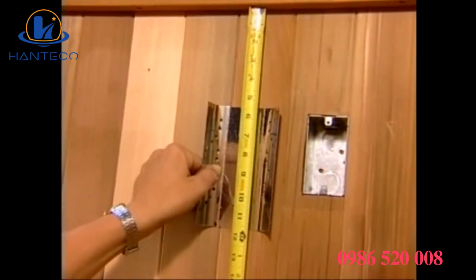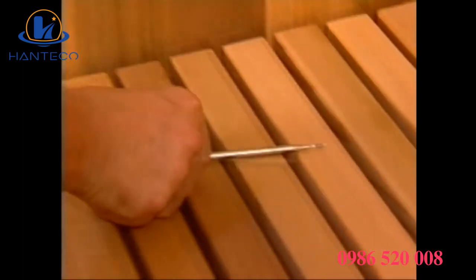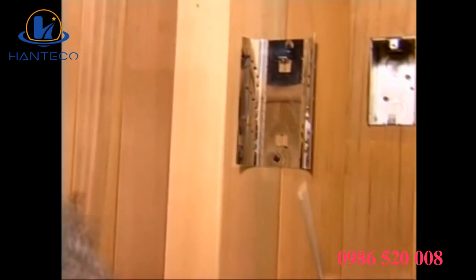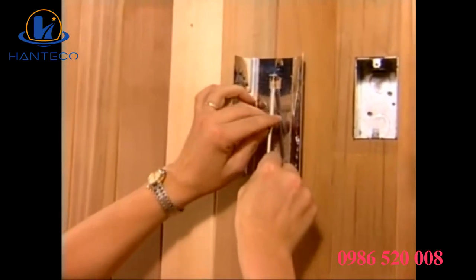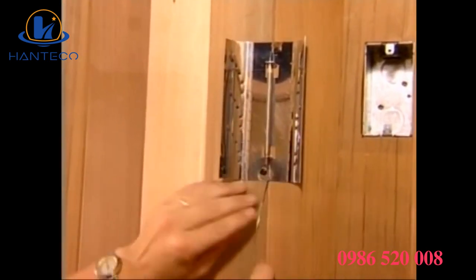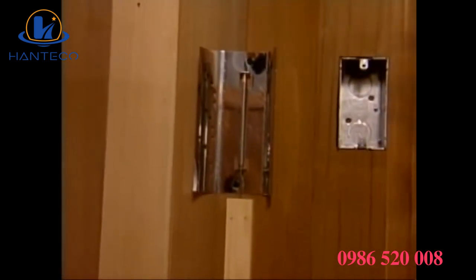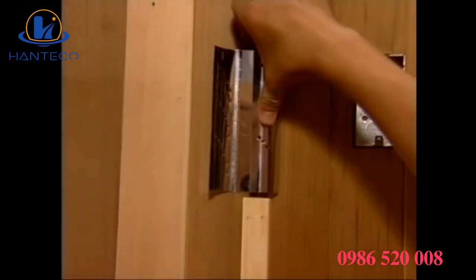If possible, the bulb should be installed a minimum of 12 inches from the side of the heater, and the bottom of the bulb cover should be a minimum of 12 inches from the ceiling. The bulb and wire must be completely pulled out, taking caution not to kink the wire, run it up the wall, and cover it with the molding supplied. The sensor wire must not be punctured when nailing the trim piece in place over the wire. The metal bulb guard will hold the capillary bulb in place.